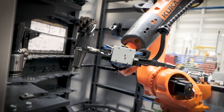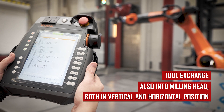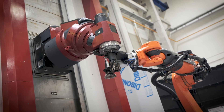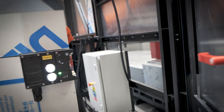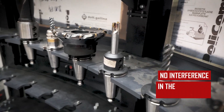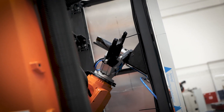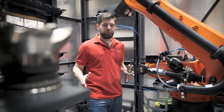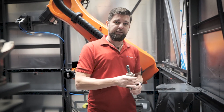The robot moves in six axes, which gives it a lot of flexibility. So it does not do the exchange only into the spindle of the headstock, but also into the milling head — both in horizontal and vertical position. It works in its own enclosed space with automatically opening doors, a rack for tools, and a cleaning station that cleans the taper and the tool before the exchange. The robot is designed for minimum maintenance and maximum effectiveness. Should the operator need to enter the robot area, the machine doesn't need to stop, because the robot doesn't interfere with the machining process in any way. If he wants to remove or add any tools from or into the rack, he would use this special pocket over here.